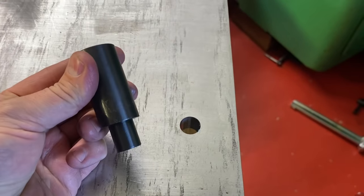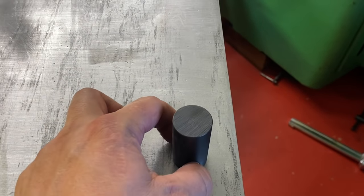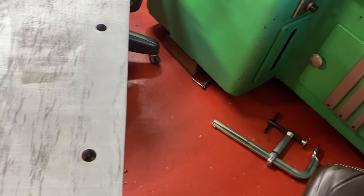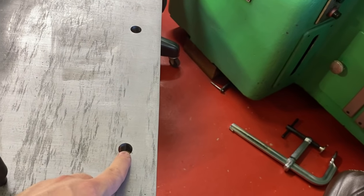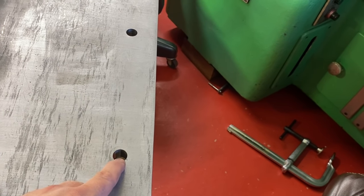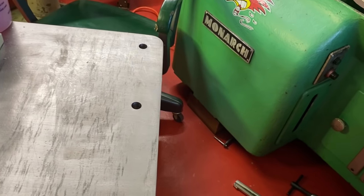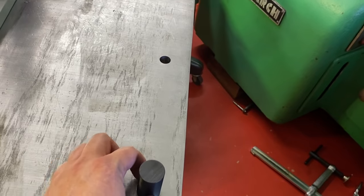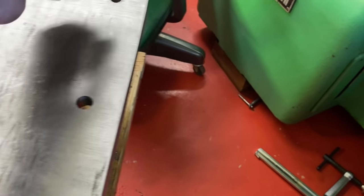And then here's one of these fixture stops. Very snug fit. I think it's going to work out awesome. I measured one of these and they're about a thou under. And the reamer is 0.625 even, nominal. It's possible that with this whole setup with the drill and whatnot, it maybe wallowed out the hole a half a thou. So we only got about a thou or two clearance. The way this feels, I really don't think it's over 5/8 in the hole. It's really, really good.